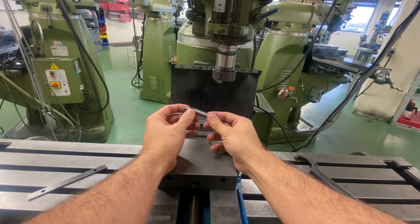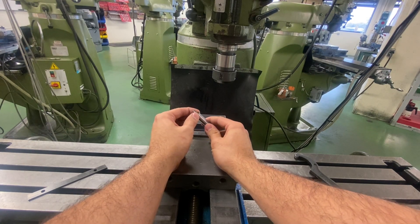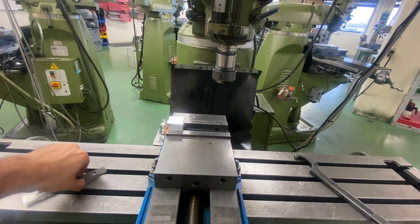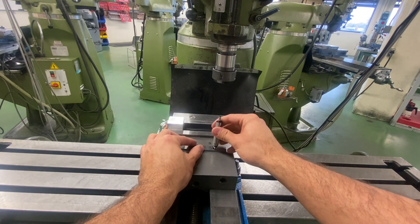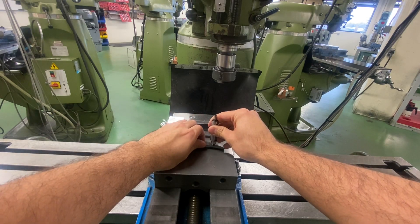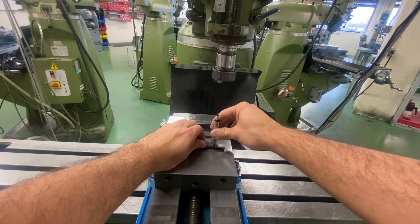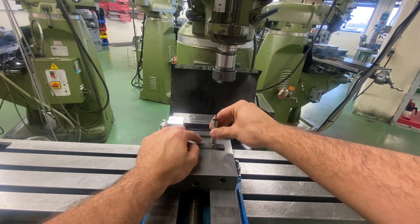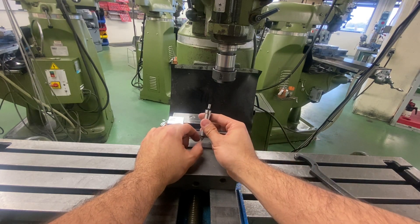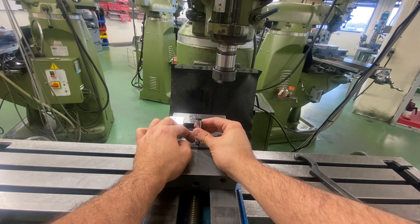I want to make sure I am chucking onto the body, not onto this spring surface here. What this pointed edge is used for is if I had my workpiece and I needed to line my body to the hole, I could use that and have it bring it in until it runs true — I could dial it here. I could also use it somewhat as a wiggler to help me locate an edge.